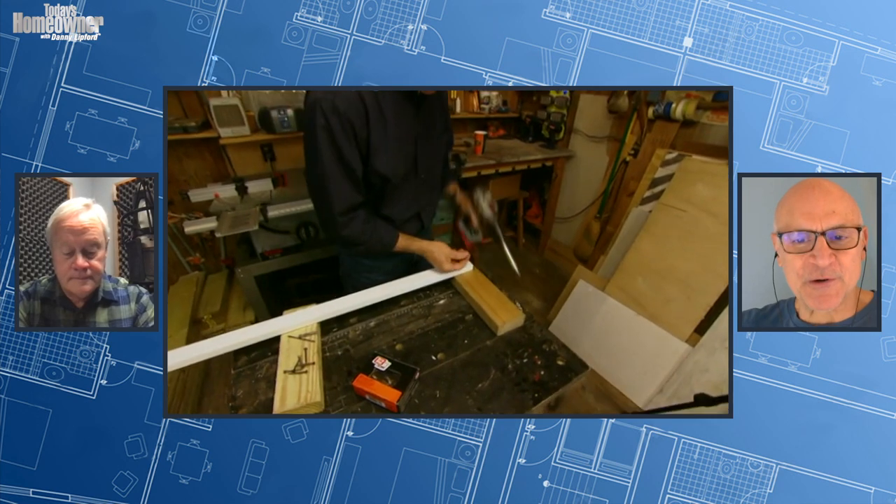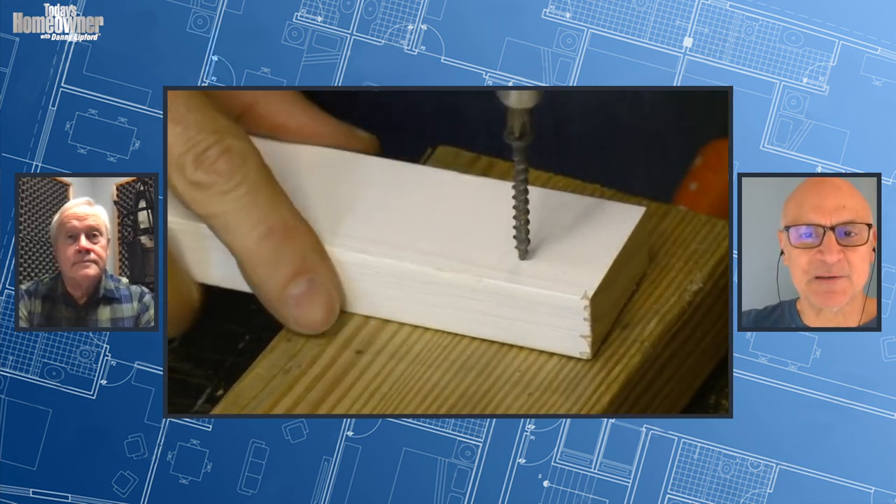There are a lot of tools out there that a lot of people aren't aware of. And one of the tools in this next tip will really help prevent the very frustrating situation of installing screws and making wood split. You use a lot of cordless tools these days and they're great — they speed up the process, but they also make it more prone to splitting. How can you avoid this problem? Well, the secret is to drill a hole first. A lot of people don't; they just drive in the screw and it'll split the board, especially with three-quarter inch or thicker boards — I've even seen it split a two-by-four, which is an inch and a half thick. And if you're drilling near the edge or near the end of a board, splitting is much more likely to happen.